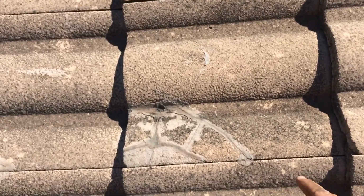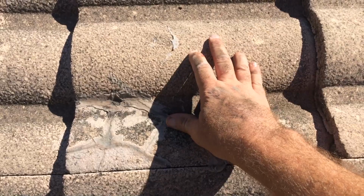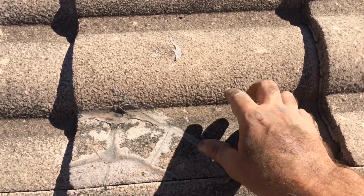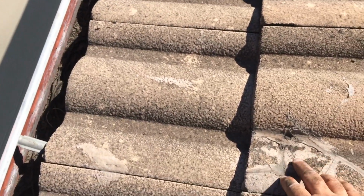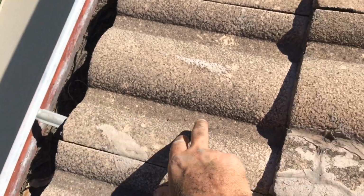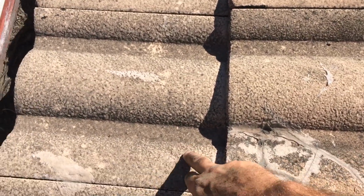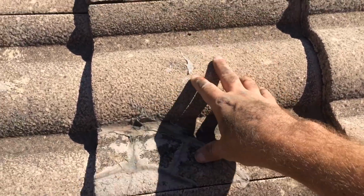And it's very, very common for them to come down here, silicon the tile up, pull this tile out that was good, put it where this broken one was, and then they silicon this up and they put it down here. And the reason why they put it down here is because they can't get this tile out because it slides out and hits the gutter, right? So it's not easy to replace, but they kick this one up, pull this one out, put the dodgy one in here,